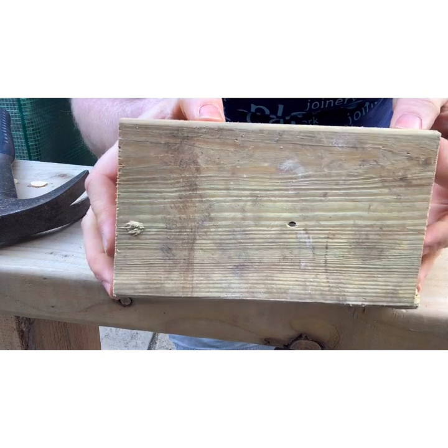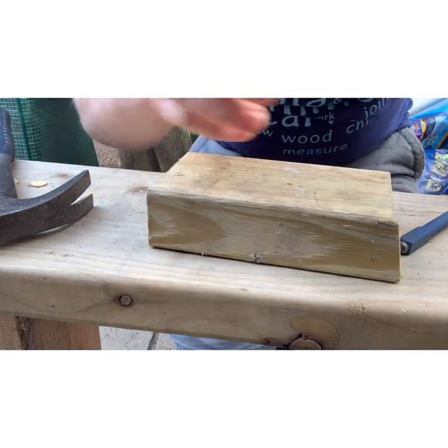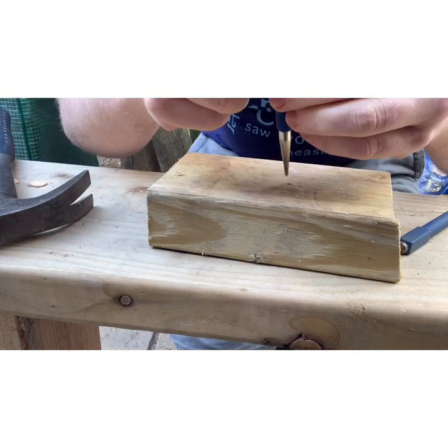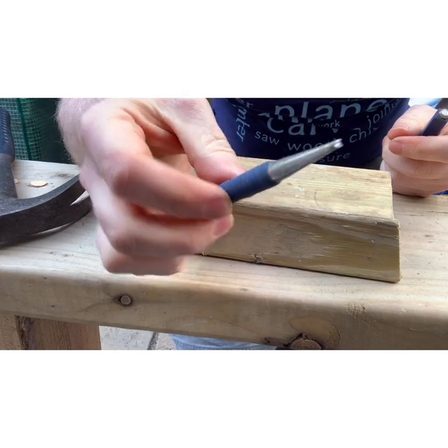If you're doing skirting board or architrave, that's perfect — you don't want to damage it. If you did it using the rounded nail punch it would just slide off and make it a nightmare. So all it takes is an old nail punch and a file. Hopefully that helped — please hit like, please subscribe, stay tuned for more, and if you've got anything to add please leave a message down below. Thank you very much.